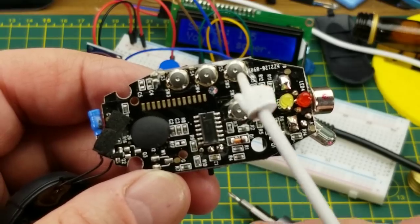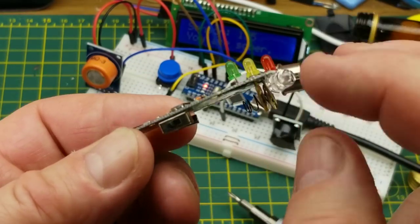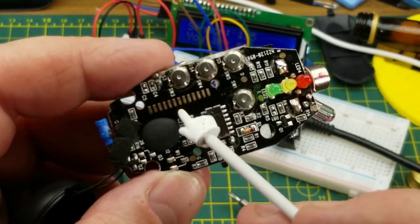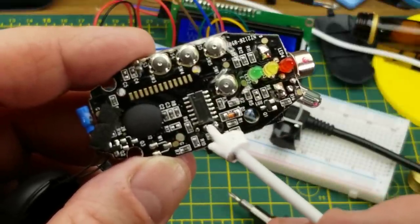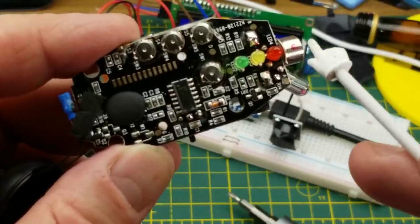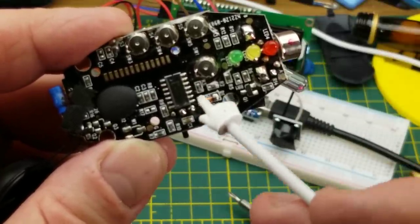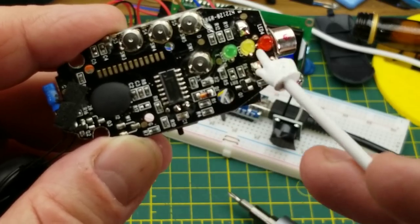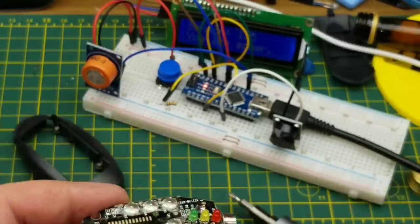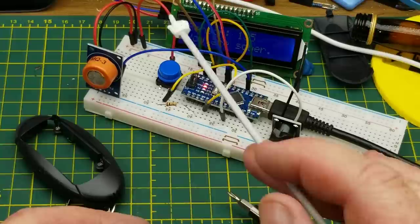So I'm wondering if there's like three separate circuits in here. There's this switch here, which turns the LED on. There's this blob doing the clock functions. And then just this quad op amp taking the voltage from the alcohol sensor and using it as a comparator to drive these guys. And it's entirely possible that that sensor there is internally very similar to this sensor here, probably even the same.